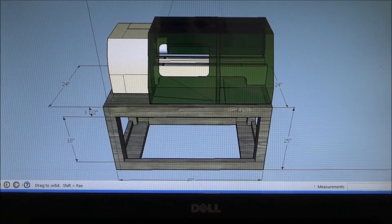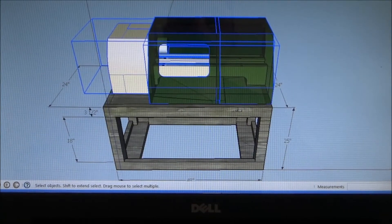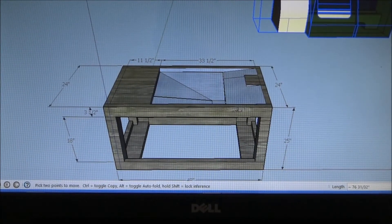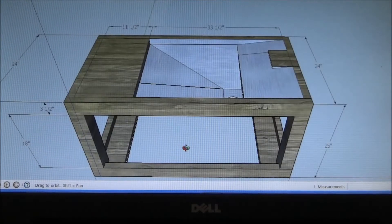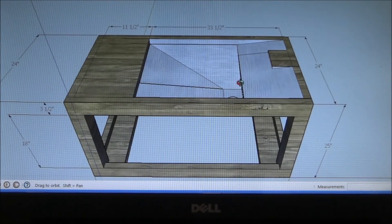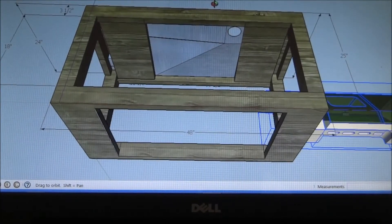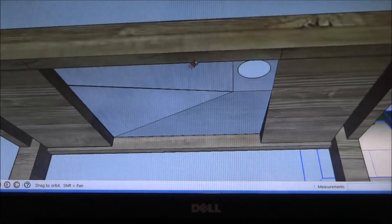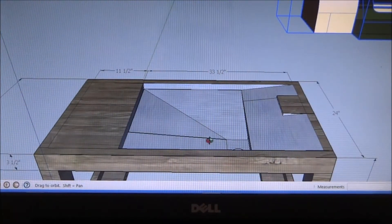I chose to build my own stand — this is it here. The stand is made out of 2x4s and 2x6s. What I'm going to do is have a fiberglass pan right here for my coolant, and you can see how the pan is going to fit in there. The bottom of the pan will be made out of the crate that the G0602 comes in, and the rest of the stand will be 2x4s and 2x6s. It will sit on casters, and I think that will be plenty strong enough for the G0602.